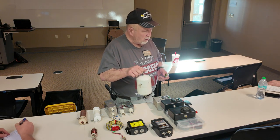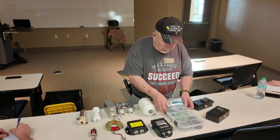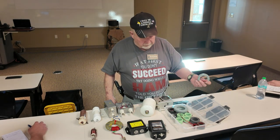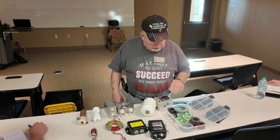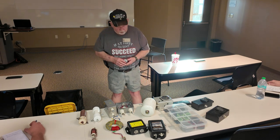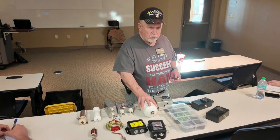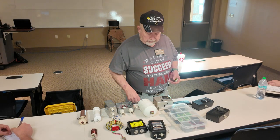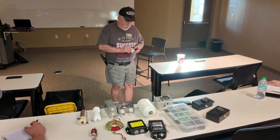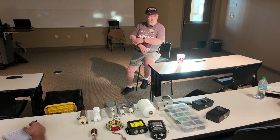Of course, it weighs a ton. It's designed to take a full kilowatt. So it's got two of these toroids in there to take the current and everything else. Because if you feed a horizontal loop with 450 ohm ladder line, then this brings the impedance of that antenna down closer to 50 ohms, so that you can match it a little easier. Most people just use a 4-to-1 and that still brings it down to where most tuners will handle it. Some tuners will not handle tremendous mismatches. Especially the ones that come in the radios that you buy.